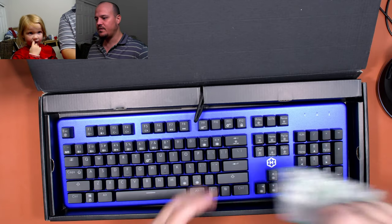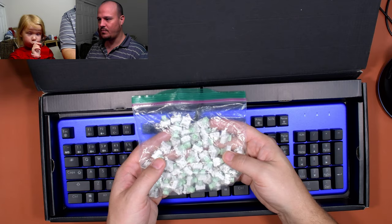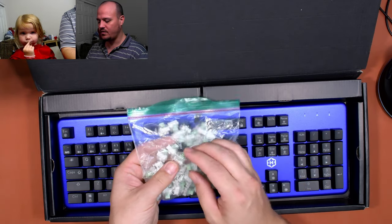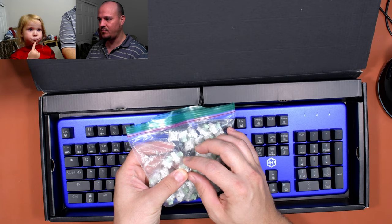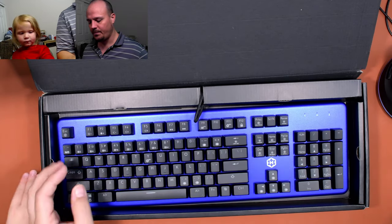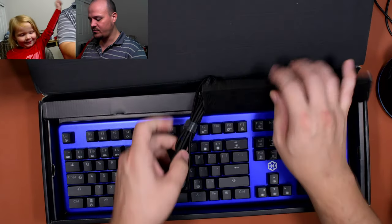Not only that, but something else about these switches is I had swapped in springs from Kailh Box Light Blue switches. So in terms of how heavy they are, they're more like a Box Navy switch. These are essentially Box Navies in disguise. So these should be more resistant and more clicky for her, and I think she'll enjoy them more.